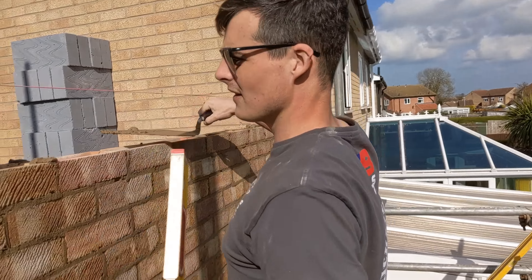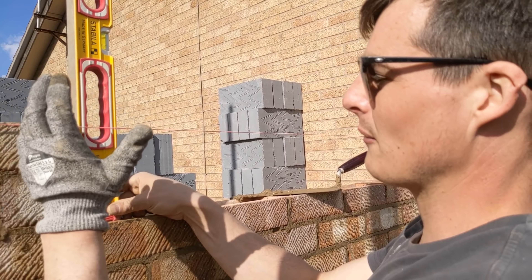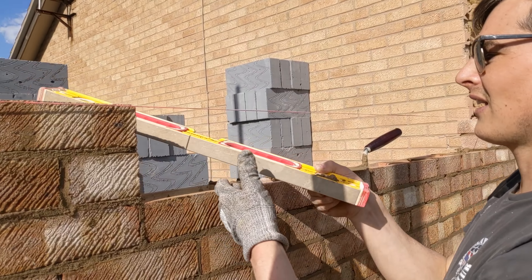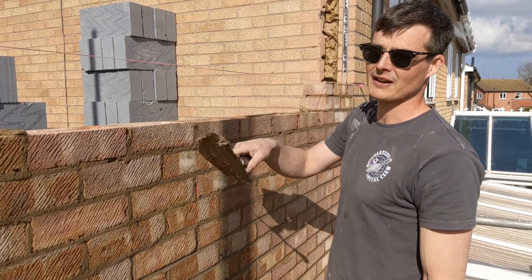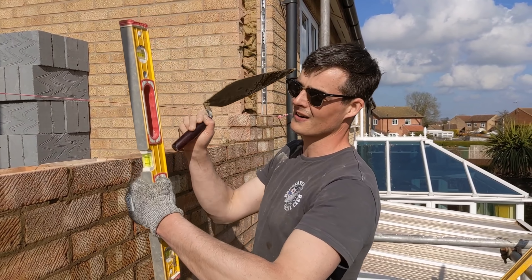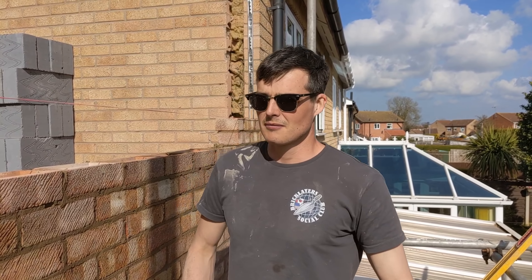Another thing: it's good obviously to always want your jambs plumb, yeah. But it's also quite handy if you slightly lean it in, because if it starts leaning out like that you'll never get your window in and it's really hard to bring your brickwork back to plumb. Whereas if it's just slightly leaning in — even just by a mil in a couple of foot — it's just so much easier to keep plumb. Obviously you want your jambs to be plumb, but that's just a handy trick to always make sure they will be plumb. If it starts going one way it's impossible to whack it back, whereas if it's leaning too much that way it's easy to bring it back into plumb. Try and keep them plumb though.